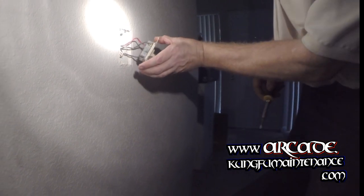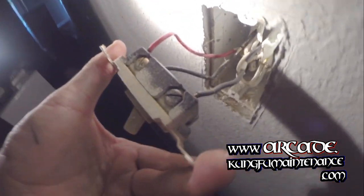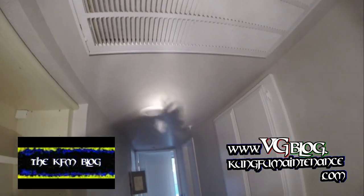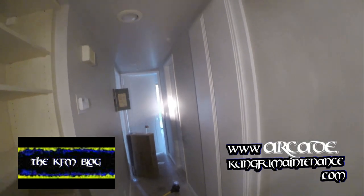So the question is, where is our hot common wire? It's easy to tell on this one — looks like the bottom wire here, the black one. This one most likely has power coming in down here, coming up to here, going over to the light through the two travelers, and switching it to close control on both sides. That's how it works.